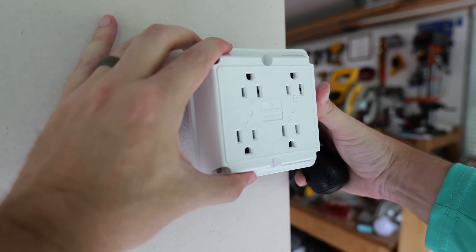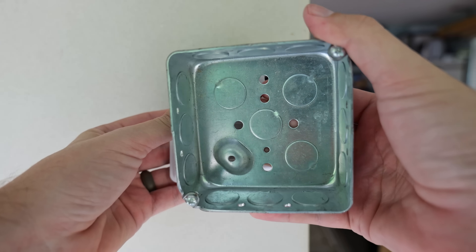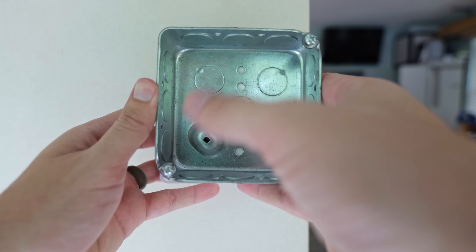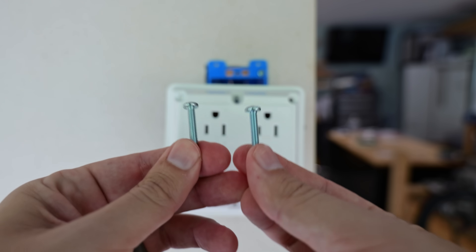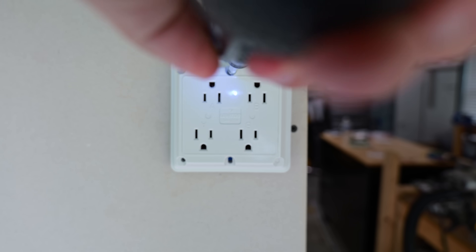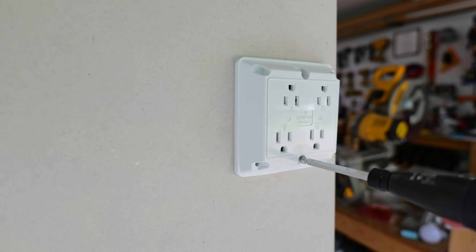Now that this is all wired up, we're ready to put it into our box. To install this into a single gang box, I'm going to have to remove some knockouts up at the top and one on the bottom in the middle of this receptacle. If I was installing this in one of these four by four metal boxes, those holes are already punched out, since these metal boxes only have two places where screws can go in diagonally from each other. Then I'll take the supplied screws that came with this receptacle, push everything back into the box, and tighten them down. I'll have links in the description for everything in this video, including this electric screwdriver, which has saved me a ton of time.